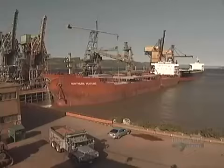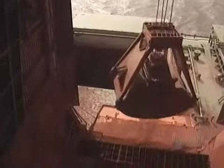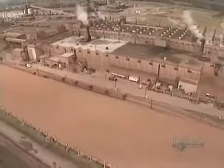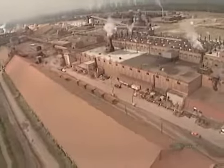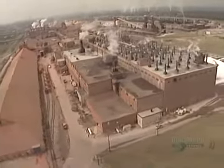Aluminum, so widely used today, and the world's most abundant metallic element, does not occur in a natural state. The most available source of aluminum is actually bauxite. Bauxite is mainly mined in tropical countries and carried by boat to the Quebec port of La Baie. The aluminum atom in bauxite is bonded to oxygen molecules. These bonds have to be broken by electrolysis to produce pure aluminum.